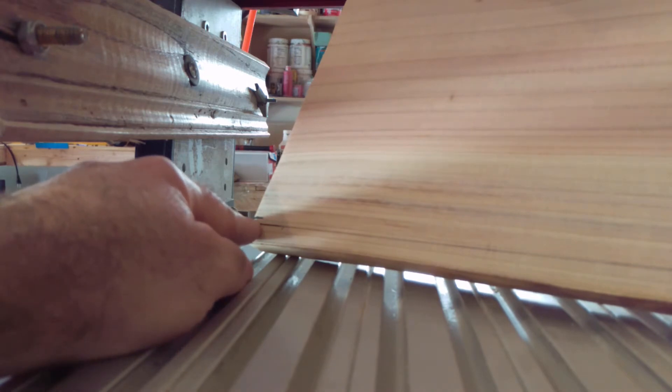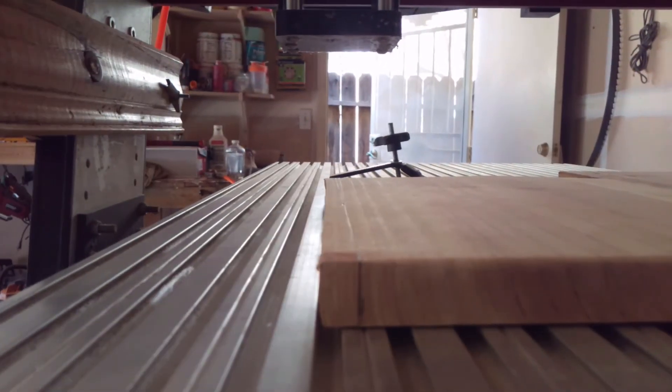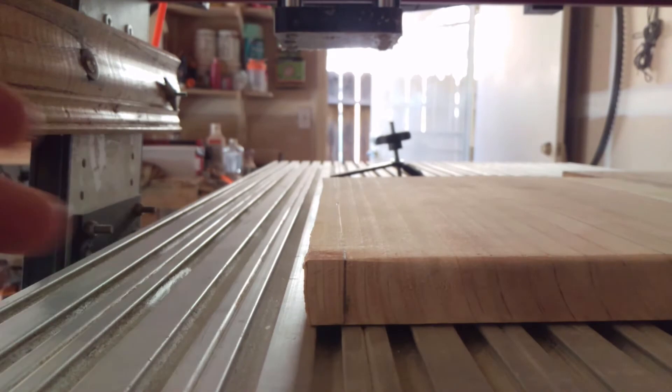What I've done is describe a pencil line on here — actually I put the first pencil line on crooked, so I just marked five-eighths of an inch from each side. The whole board is basically eleven and a quarter inches wide and I need ten inches for my material space, so I split the difference and called it five-eighths of an inch off each side. That gives me a straight line.